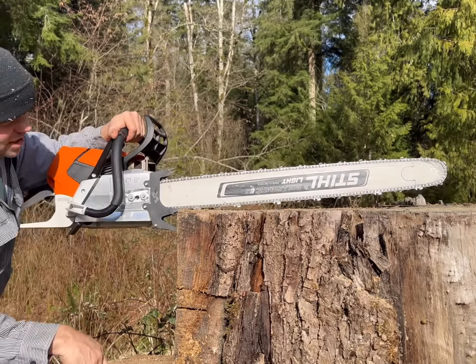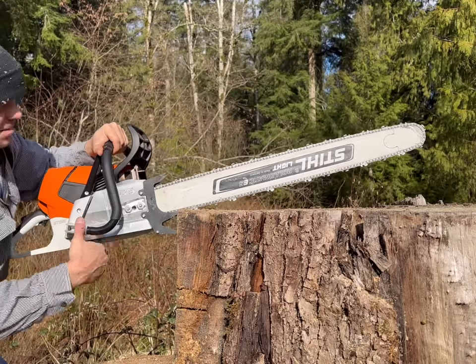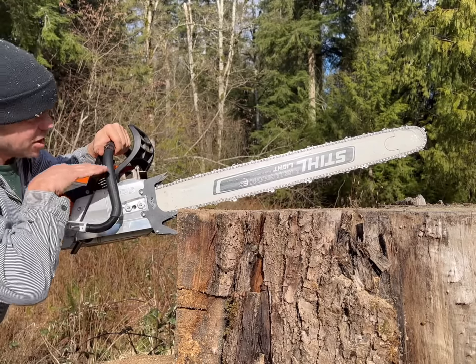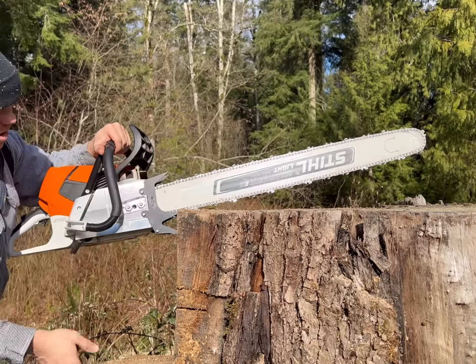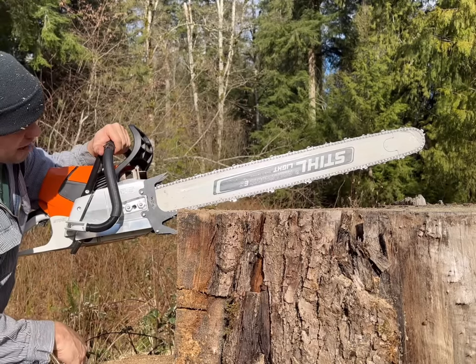If your chain's too aggressive from bottom to top, you could always freewheel the saw in and hit your center point, then start to articulate down. I do that sometimes because I get a little aggressive on my rakers — I freewheel the saw in until I get to my center point, otherwise the saw jolts back and forth a little bit and I fight it.